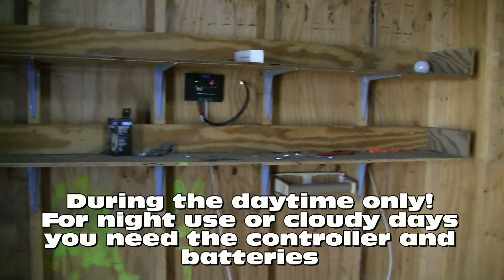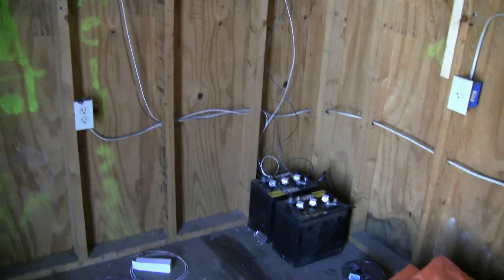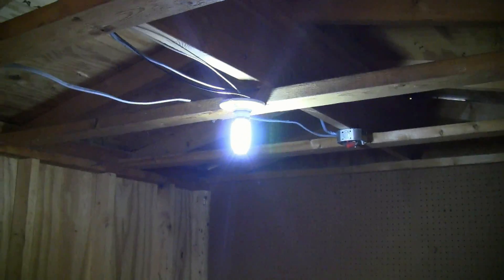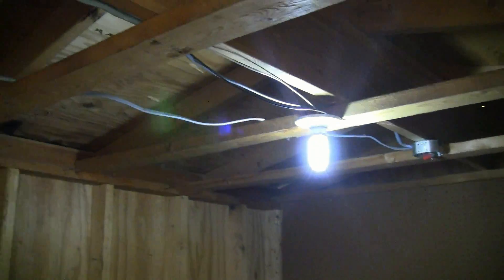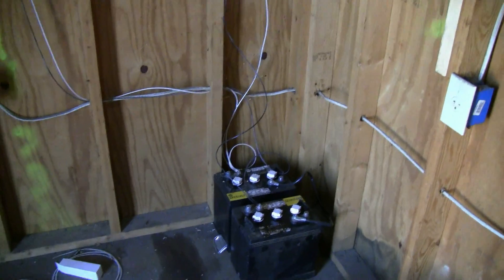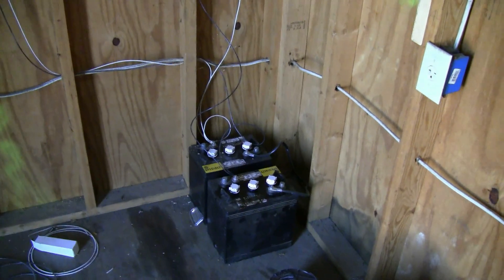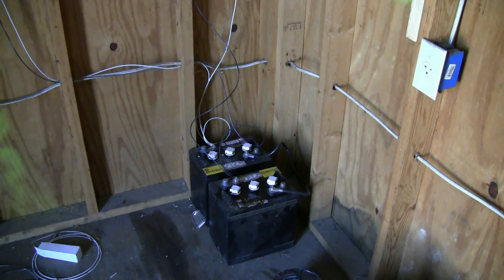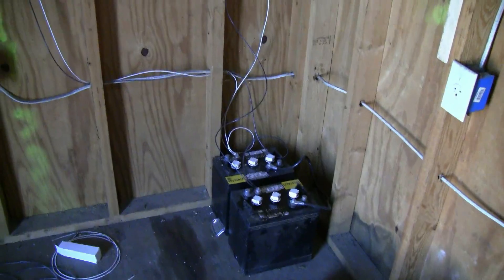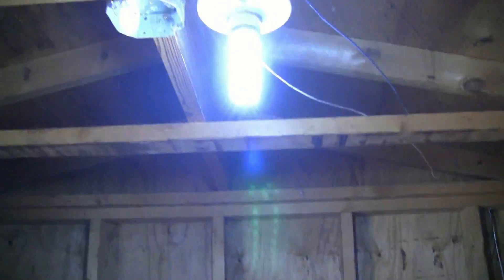I'm in my shop a lot and most of the time I'm out there during the day and I've got lights on, so there's an actual positive use for solar that I think I can capitalize on. The reason I went with the DC lights — I said 10 to 30 volt — first I wanted to see if they would run off just a solar panel. Second, you don't have the conversion losses associated with turning DC into AC and then powering your light fixtures with it.